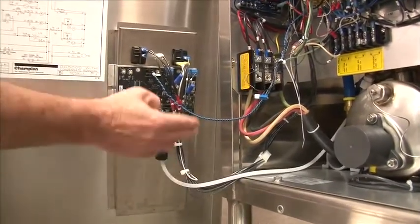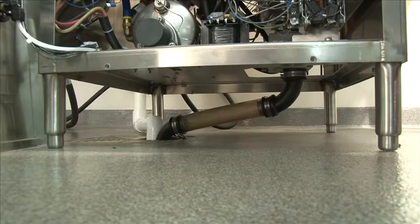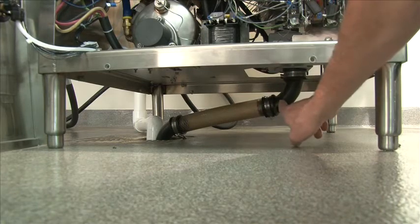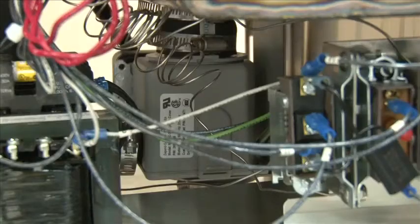Do not pull these two components away. The drain connection on the DH5000 is located underneath the machine — 2 inch OD dimension. It's a slip connection. You can use CPVC or copper, either one. It should handle 15 gallons per minute of water.